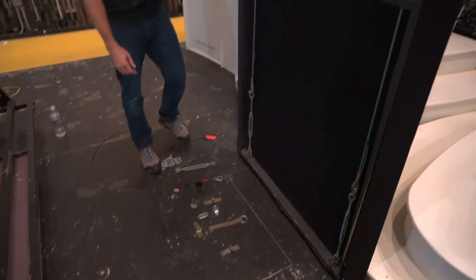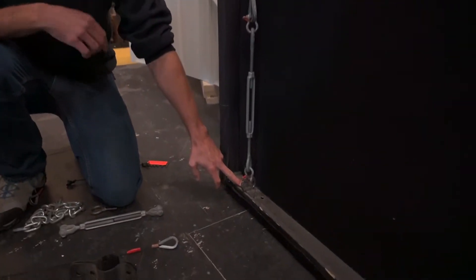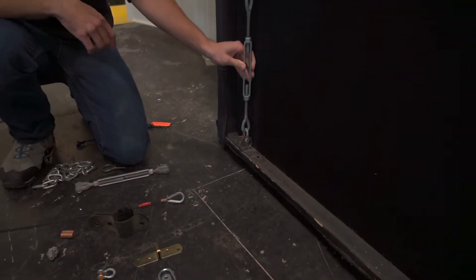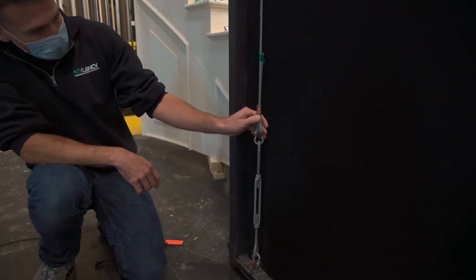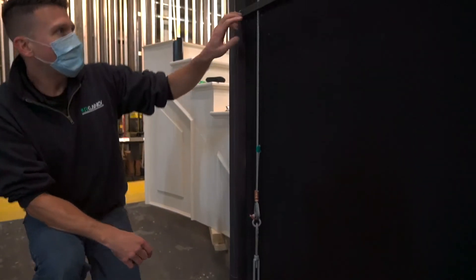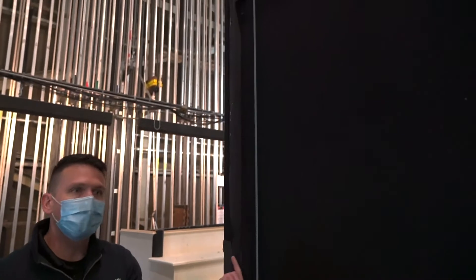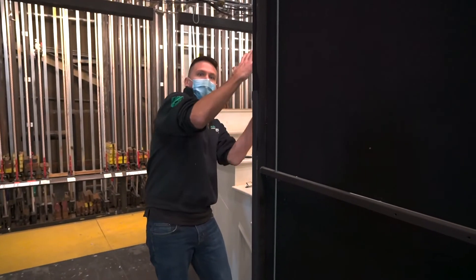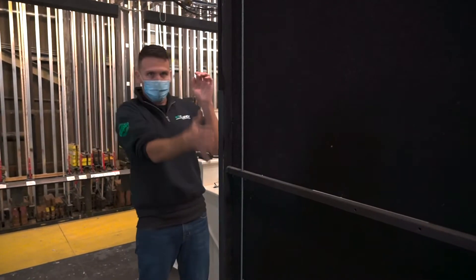Here is a soft cover flat. Down here, we took a D-ring plate that's actually welded to the steel frame, which is nice. We have a rated shackle to a turnbuckle, then another shackle, and here's our lift line — a swaged sleeve right there that attaches the cable going up. One nice thing they did here is running it right through the frame, with holes drilled to run the cable up through the center. That keeps a nice center of gravity and prevents the flat from listing forward, giving you a nice plumb drop.